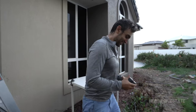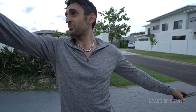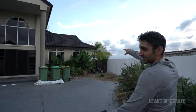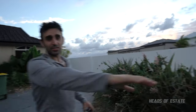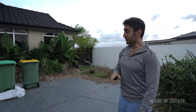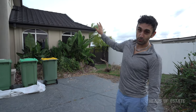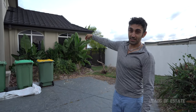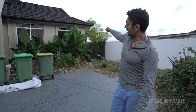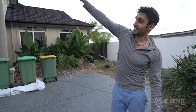Now, what's next? I've got coverage up to here from that wide angle. So next up, I think I'm going to be placing one over here on this angle so I can get this field in front of me. Now this setup is going to be a little bit trickier because I don't actually have an access panel to get up there, so I'm going to be getting my ladder, going up there, removing the tiles, jumping in through the ceiling, getting the wire through there, and then finding a way to fish it through, maybe going to the actual roof attic and connecting to the NVR.